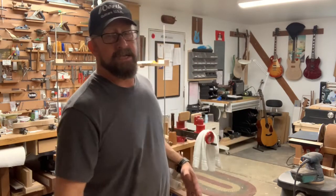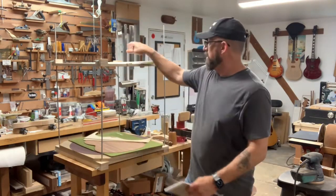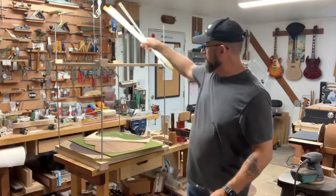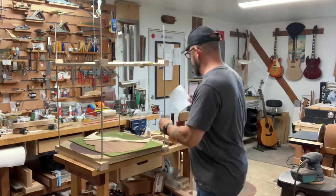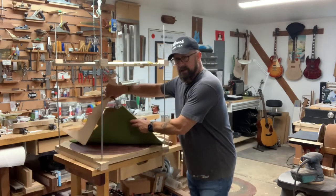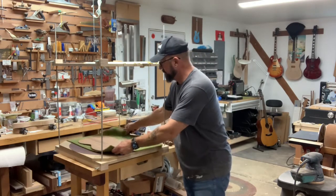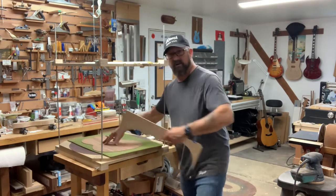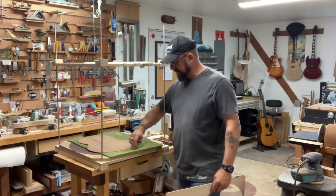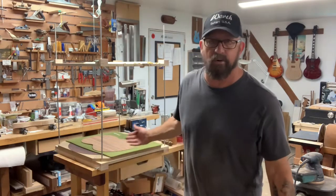It's hot. So today, remember the last video we did, the Go Bar deck. Got all the Go Bar fiberglass rods, and we got the deck. I went ahead and put the 15-foot radius dish, this right here, that has sandpaper in it. Instead of gluing directly down onto the sandpaper and possibly denting the back of this piece, I put this pad inside there. And that'll only throw off the radius by 1/4 of an inch.